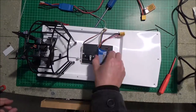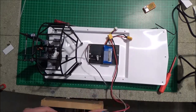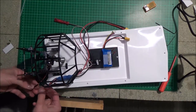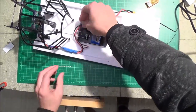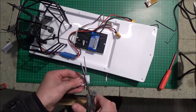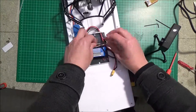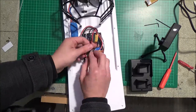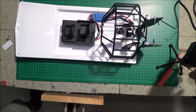I chose to put the electronics underneath the seating area. I was using an S3 800mAh battery, a 20-amp speed controller that came with it, and a Micro Orange RX receiver. After using the boat I found out it's not the best place to mount your speed controller on the outside because it will get wet. The cables from the motor weren't very long, so you'd probably need to make an extension fly cable if you want to mount the speed controller elsewhere. There is a small rubber grommet at the back of the tray area that you can feed the wires through to keep that area waterproof.